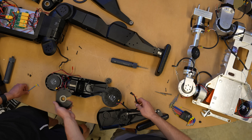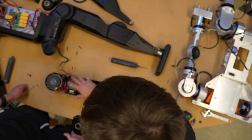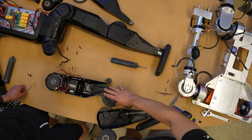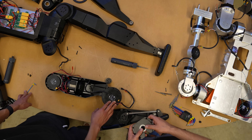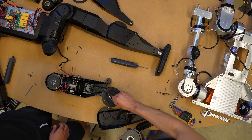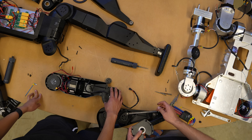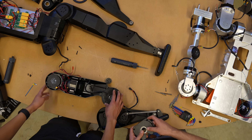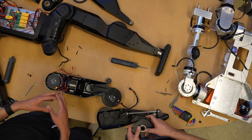As we've gone through our different designs, a common issue has been dealing with all the wiring, packaging, and routing — especially with these motors where the wiring comes out the back and goes radially outward. In some more expensive humanoids, you'll see actuators with a hollow shaft, allowing wires to be routed through it and making the mechanical design easier. The reason we didn't go for that is because we're really focused on making the robot as accessible and affordable as possible, so we want to use actuators that are off the shelf, already mass-produced, and reliable for consumer use.